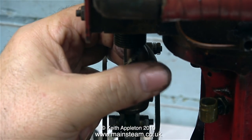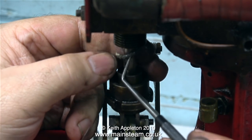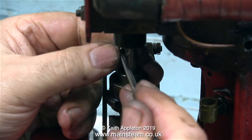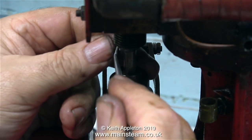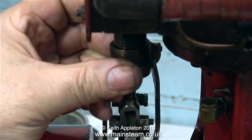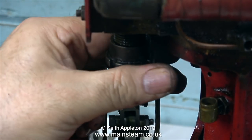The stuffing glands on a 5A are different to the ones you will normally find on smaller models. They have a metal part that pushes the gland material up into the gland, and that's tightened into place with a ring. And this generally follows full-size practice. I worked on a big water pump a while back, a full-size one, which used exactly the same system.